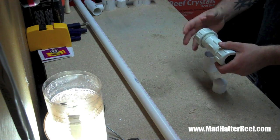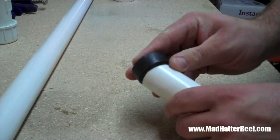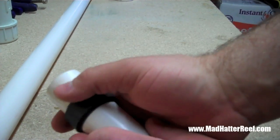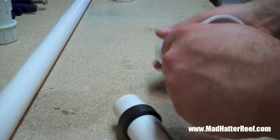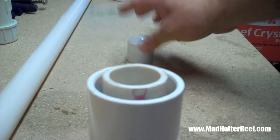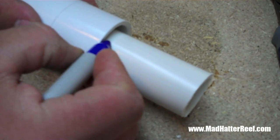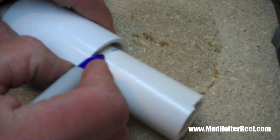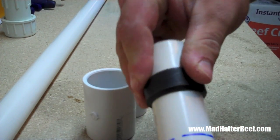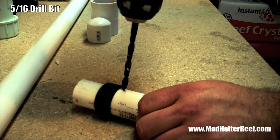Here I am taking apart the repair coupling so I can get the rubber washer out from it. Now I'm going to place together the Stockman in a dry run so I can get a better idea of where I need to drill the pipe on the inside and make some marks. Now that I have it all together, I'm grabbing my Sharpie and making a few marks to where the slip coupling actually covers on the pipe. The space between the rubber gasket and the lines is where I'm going to drill my holes so the water can actually enter into the pipe.